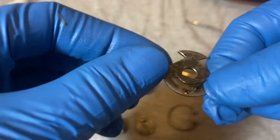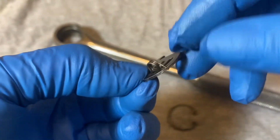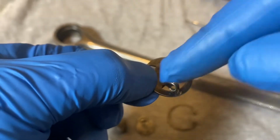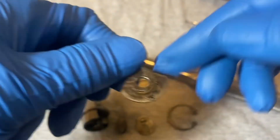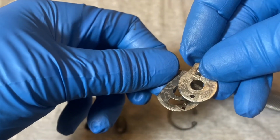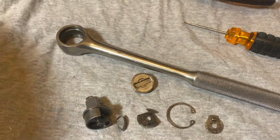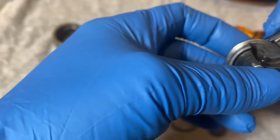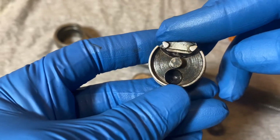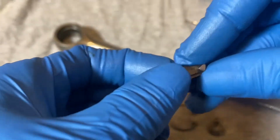That's what it looks like. On the bottom side, you see the spring. It sticks through the hole there. One of the prongs for the spring, and then it goes through this cutout, the other prong, and then that connects. You put that other prong onto the top switch plate to get that switching action. And here's the pawl. The pawl rides like this, and it floats on the spring. This is what the pawl looks like.